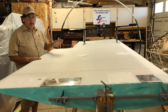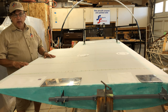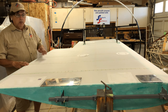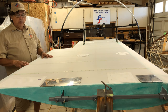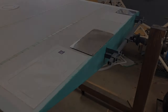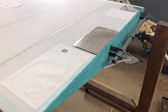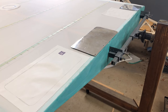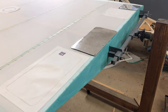We've got five standard inspection rings, and up front we've got two large inspection areas for attachment of the wing to the attachment points on the fuselage. We'll take a quick walk around and show you a close-up of what all the inspection rings are going to look like, and then we'll get started on the process. Let's first take a look at the attachment end of the wing. You'll see there are two large inspection panels covering an area that will be open for the attachment of the main bolts to the fuselage.